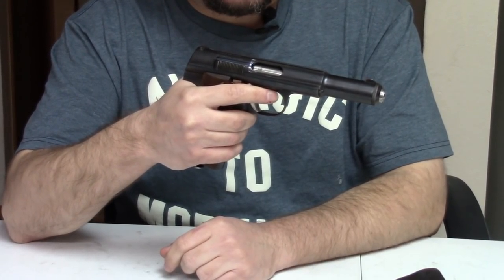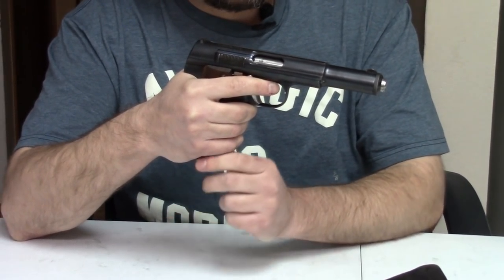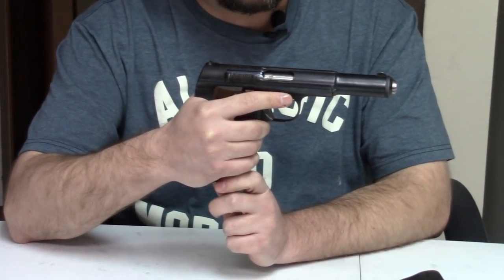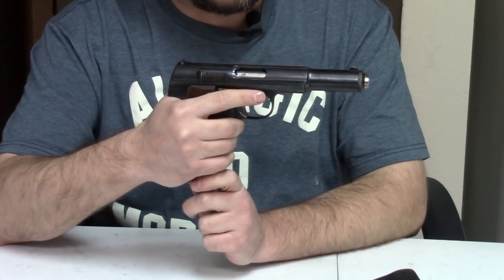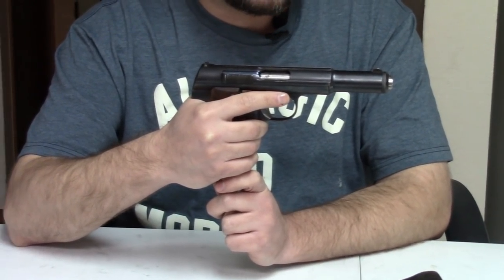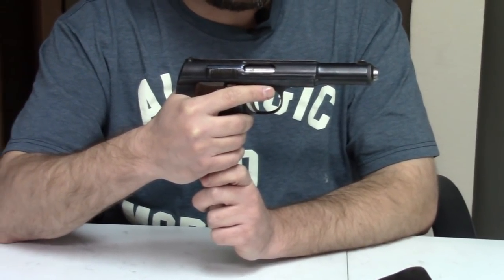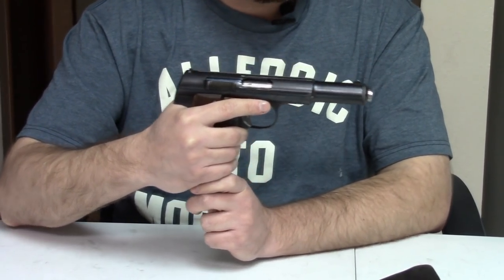The fact that there are some non-locked breech, direct, straight blowback guns. It's quite interesting. To disassemble these, it's pretty simple. These are, to some extent, based on Browning's designs. You just kind of lock the slide back in the takedown position. Then there are the notches in the barrel. Rotate the barrel. And then let the slide go forward, and then the slide and barrel come off the frame, and from there you can further disassemble. It's pretty straightforward, much like, say, a Browning 1903, or, you know, what am I thinking of? There's some other ones. You know what I mean, guys. But that kind of era of guns and that style of rotate the barrel. Spanish Ruby is another good example.